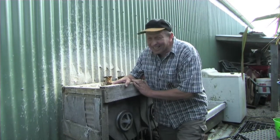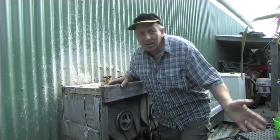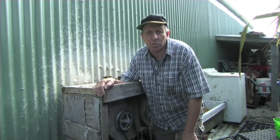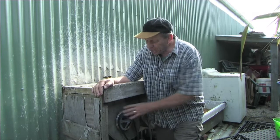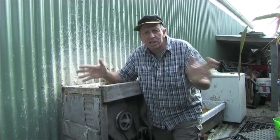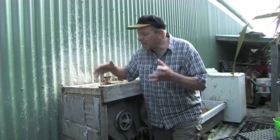They're a little bit rickety, but they've been going for 25 years and they produce vast amounts of pulp. So this is the more rough fibrous pulp that I use for big art installations or stage sets. Now this machine is based on the Japanese Naginata beater, which has spinning blades, and it more sort of threshes the pulp to pieces. So those blades aren't sharp, they don't do any cutting, but they do an awful lot of churning. A bit like a giant kitchen blender, really.